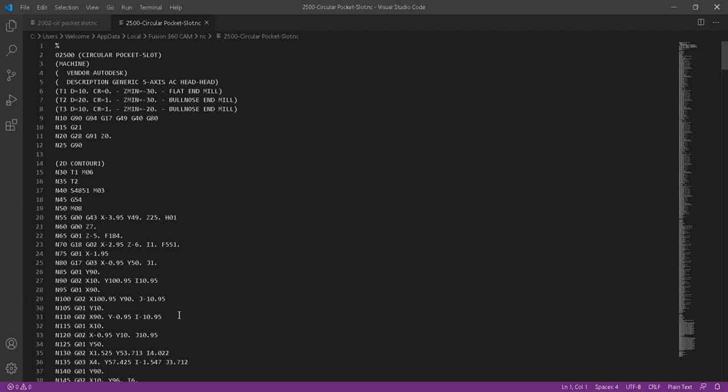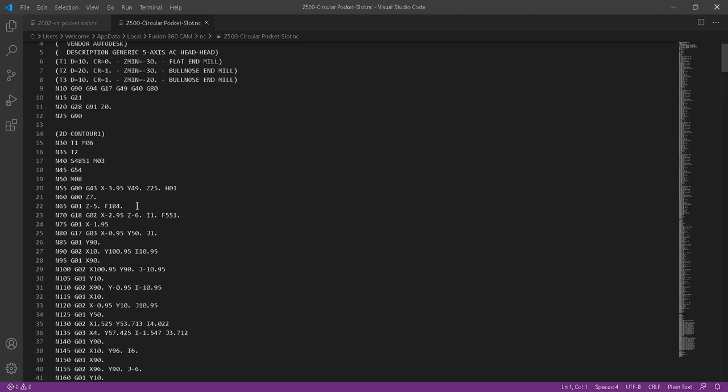In a manual program, you only trace the tool path once, giving limited lines. In the generated code you can see how tool change is applied, coolant applied, spindle settings, appropriate plane selections, and how coordinates change accordingly. It is a simple path operation so no canned cycle is necessary, which is why the program length is large.